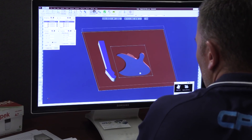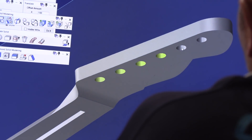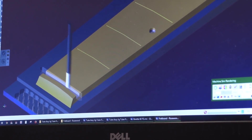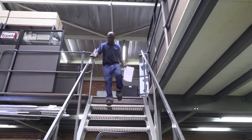Here at CPS we specialize in milling, turning, and welding of stainless steel and aluminium. When we got this guitar project from Adrian, we thought it was a great opportunity to prove ourselves. It all started with Adrian's design, and once we had all the sizes sorted out we brought it into GibbsCAM, which takes in the whole model. From there we program the tools, get the outlines, and define where to surface and the different types of cuts.